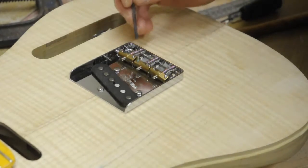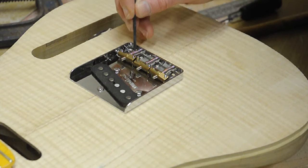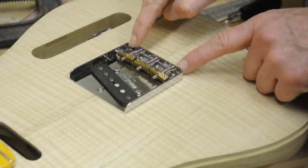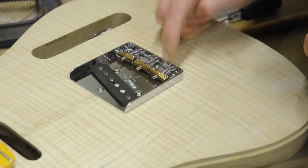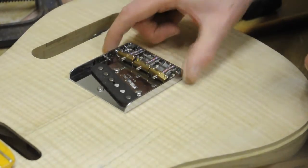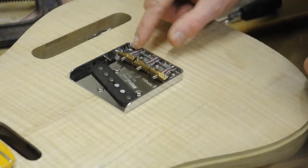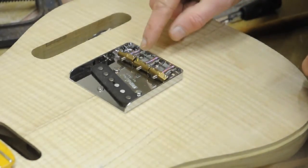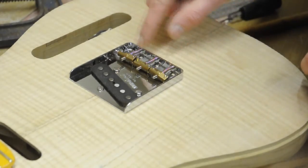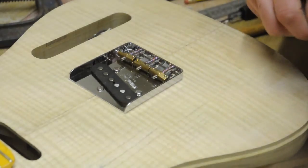The way to do this is drill through here and go all the way through on the outside two, then halfway through on the middle four. Then flip over, use the bridge again to line up using the outside two, and drill through the other four. Hopefully they'll be evenly spaced on the back — so let's try that.